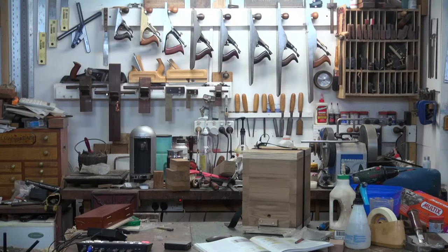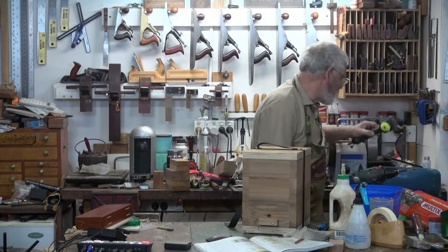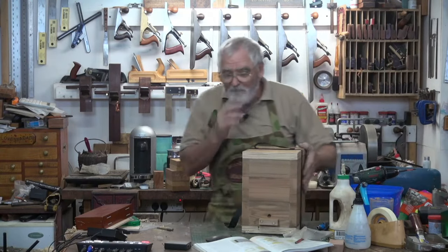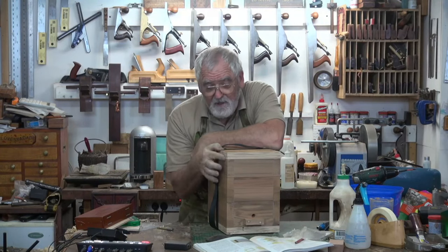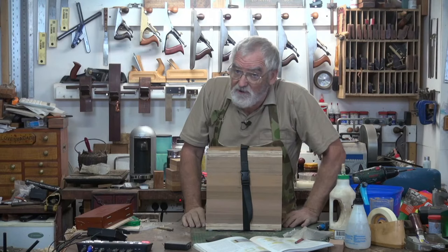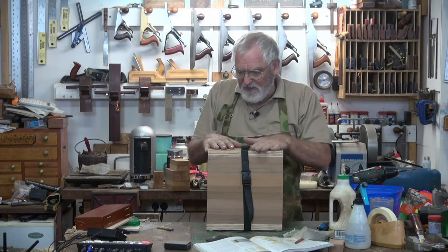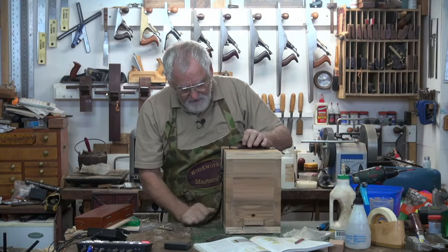The biggest problem with timber, as I mentioned at the very beginning of the stream, when we were sizing those edges to butt join them, is the end grain. Now I understand if you are using pine or something, and a lot of people do, they paint the entire thing, and that's fine. If you're using internal plywood like this is, definitely paint it with a good quality outside enamel paint or acrylic paint, because you don't want the weather getting to it. They do have roofs that go over the top, but that's another area that we'll cover in a later video.